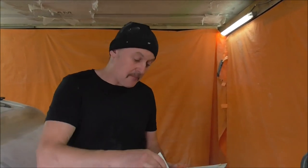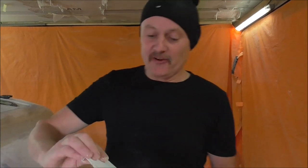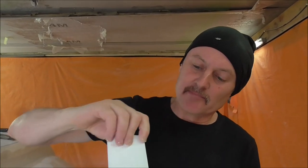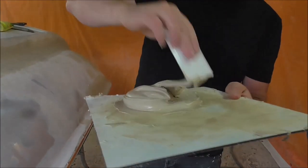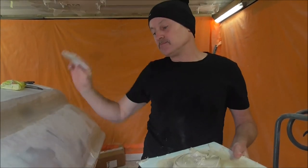Just one of my tips — it's a low quality tip, let's face it. When mixing filler, you only ever get the clag on one side of the spreader. This side with the bevelled edges is for your hands; this side is for filler. You can mix — just don't get it on the bevelled side — makes everything a lot tidier and you can spread it a lot nicer.